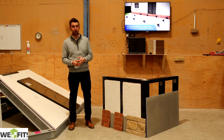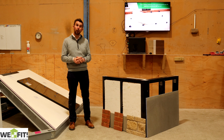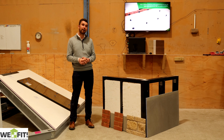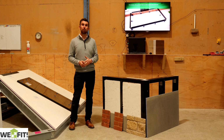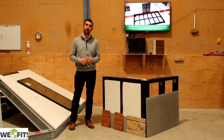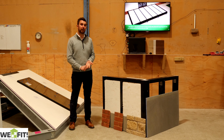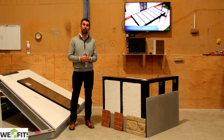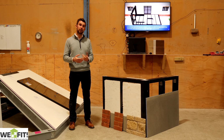The earth screw calculations are done for you. So if you are doing an installation, we'll organise the earth screw to go in and also for the calculation to be done. What that means in real money is your building inspector won't want to come and check your footings. They are happy with the certificate that says the earth screws have been installed and test loaded. That certificate is produced to the building inspection company and they just take that as the footings have been done adequately